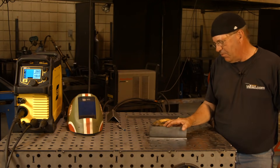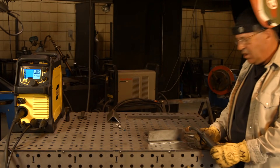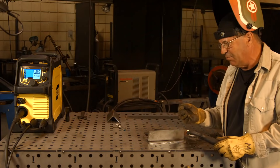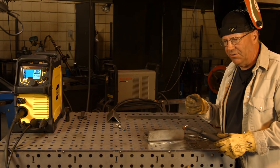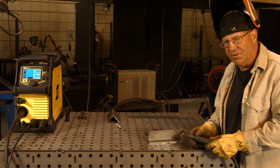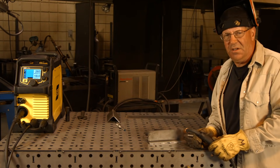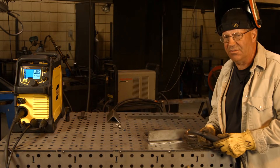We're going to demonstrate a fillet weld first. I want to make this weld pointing the wire pretty much straight into the joint, leaning back about 10 degrees or so, with just a slight oscillation along the joint. I'll be looking behind the weld — since this produces a light slag, about an eighth of an inch up on the weld pool there'll be a little shelf fluttering around where the slag is and the weld bead solidifies. I'm set at 18 volts and 265 wire speed on this machine, with about 35% inductance. It's going to sound like a hiss and put out a lot of sparks, but that's okay.